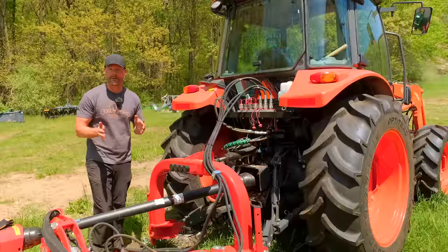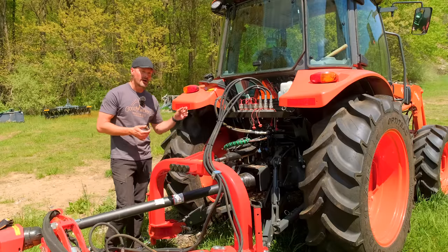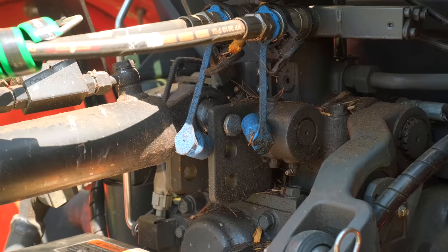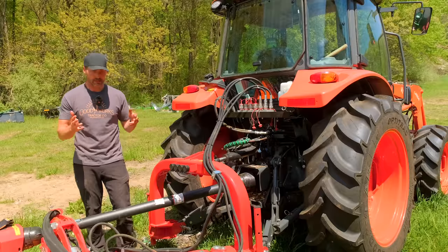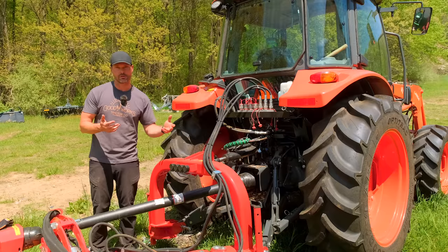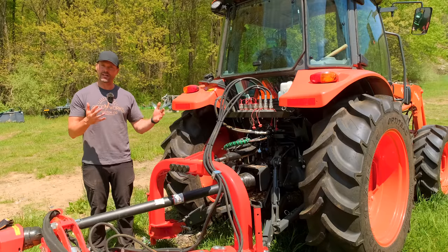Normally not found on subcompact tractors, but even that 2038R we're looking at and the Kubota M4 are going to have three holes to mount the top link to on the backside of your tractor. And different manuals will tell you different things on what they're used for. I just pulled up a manual recently for a guy who had some questions on what those holes were for on his tractor and sent him the link. The lower hole was for really light loads, like using a landscape rake. The middle hole was going to be for a medium load that's on there.